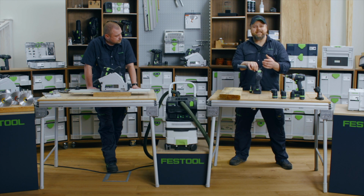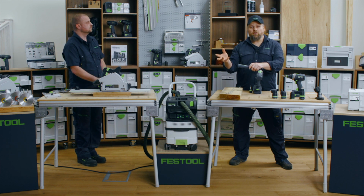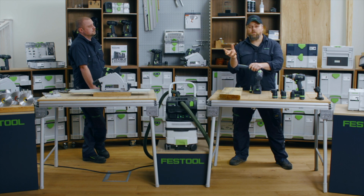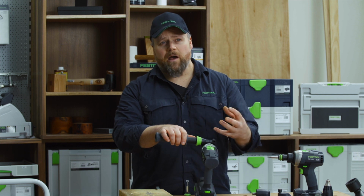It's just phenomenal. We did a test on having the selection of gears with different applications, and it can make you so much more efficient that on some projects where you'd be on the project until Saturday afternoon because you only got a 1 or 2 speed gearbox, because you've got the TPC, you can walk off the project on a Thursday morning because it makes you that much more efficient at what you're doing. Because you can select. So gear 1 is much slower, but so much more power. So you're almost unlimited on this drill as to power delivery.